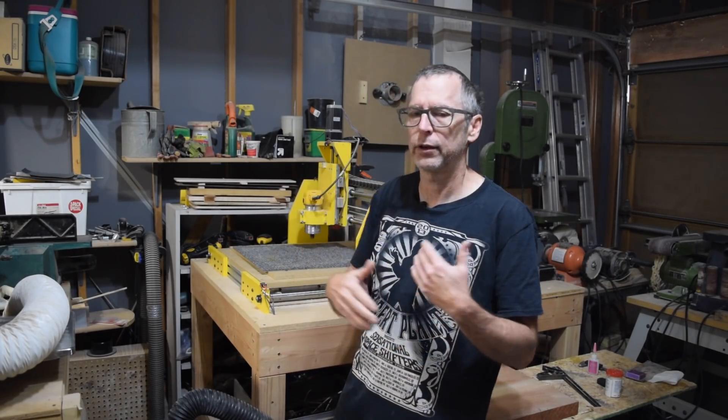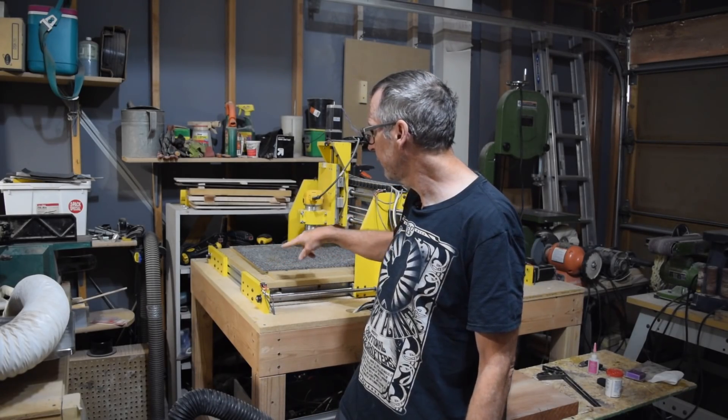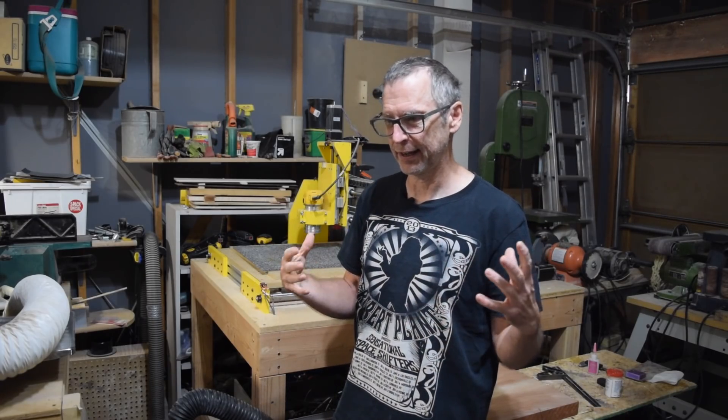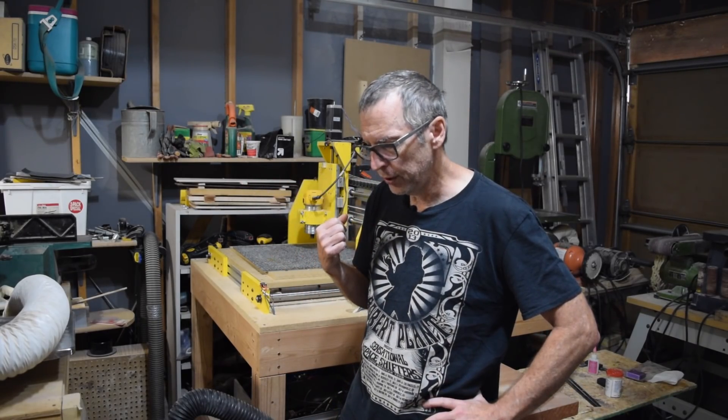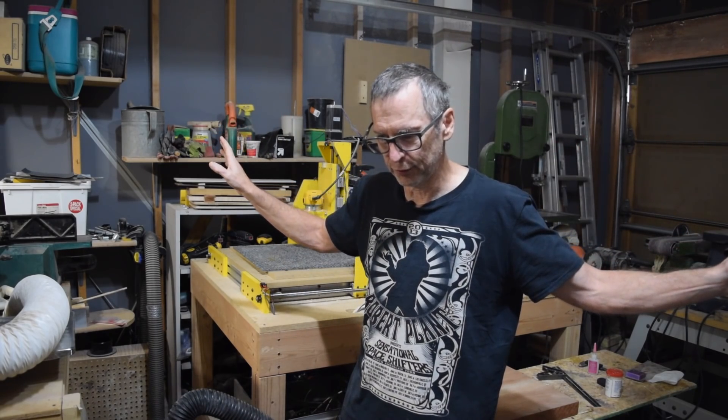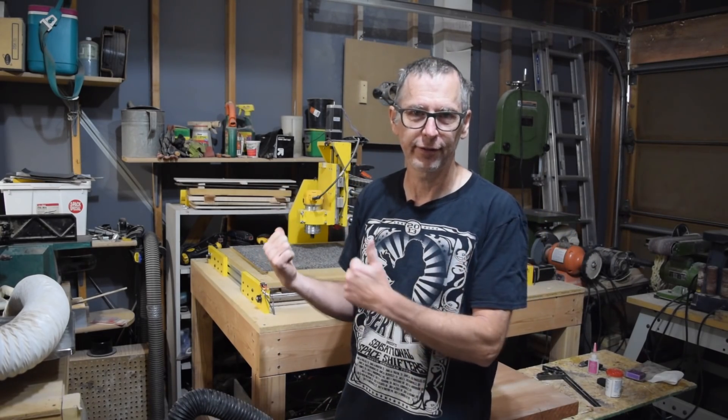As far as plans are concerned, the only part of this machine I can really offer plans for are the end plates I made, which are made from 18mm plywood — I've found that to be plenty good for this machine. You see a lot of guys using thick aluminum plates, but the plywood has worked just fine. You do have to go into it knowing there's a possibility you may have to modify those plans to suit whatever parts you end up purchasing. That's just the reality of fabricating your own project like this using components sourced from a wide range of sources around the world.